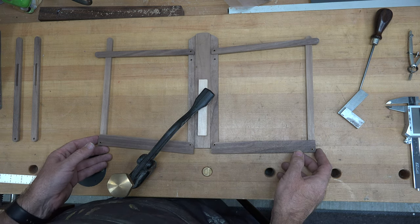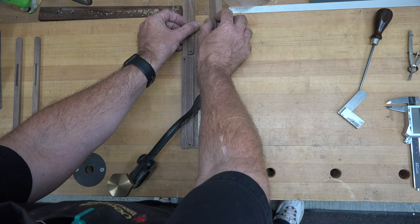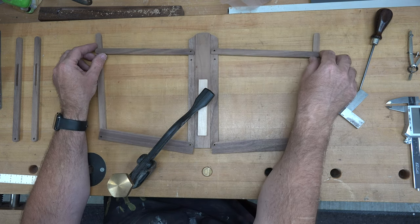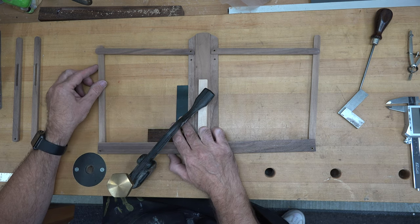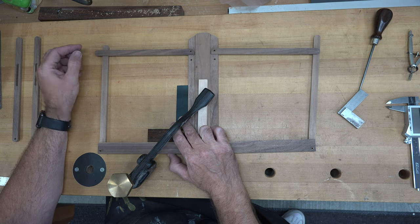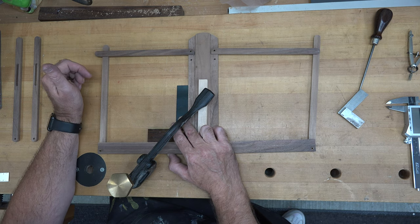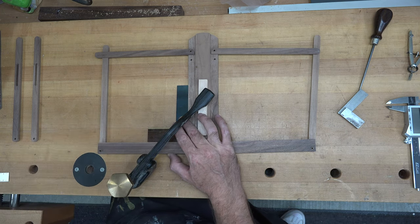When it folds up these should all end up something like this. It looks like it's going to fold up just fine, but we still need to attach these cross braces to our uprights. I'm going to get this squared off, then square each brace off, and wherever that ends up I'm going to center punch and drill a five thirty-second inch through hole right through both pieces, centered on both. I'll get the pins temporarily in place and then come back.